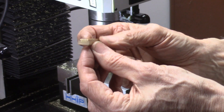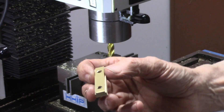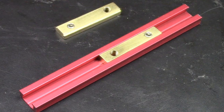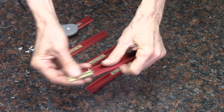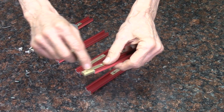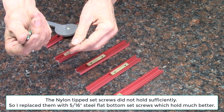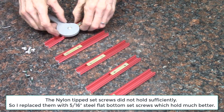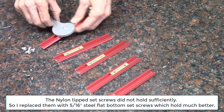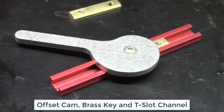There's my finished brass piece — I'll just touch it up on the wire wheel to get rid of the burrs and it should fit perfectly. The brass inserts are finished now; they slide in the channel and that lip locks them in place so they don't come loose. There are two tapped holes — in one hole I put these small set screws which have nylon bases, and on the other end I attach my offset cam screws.